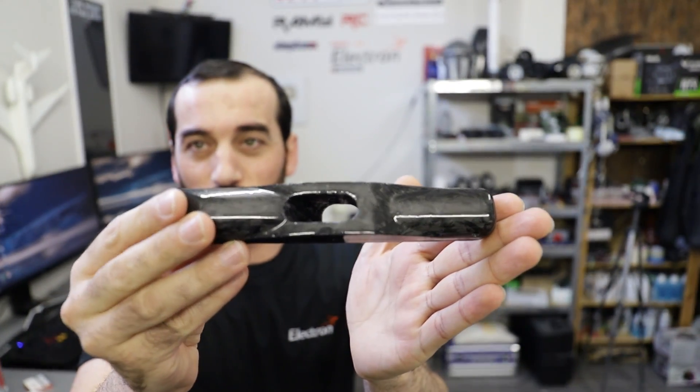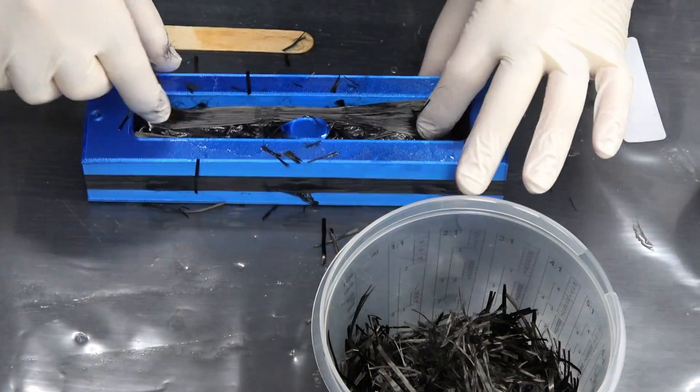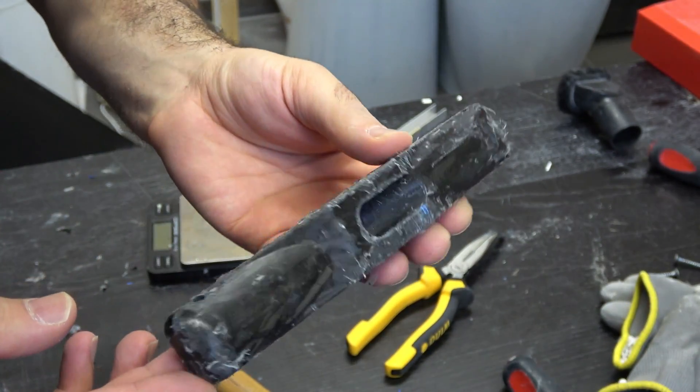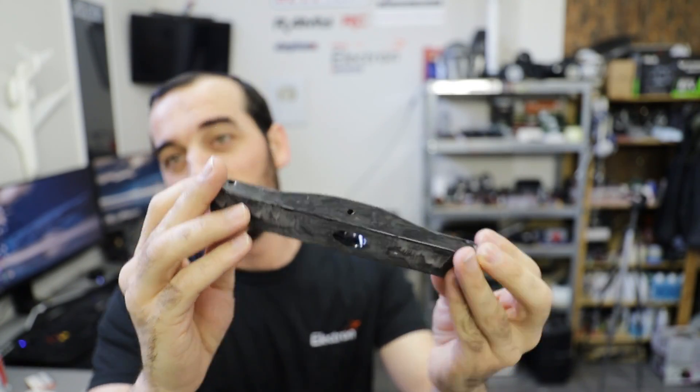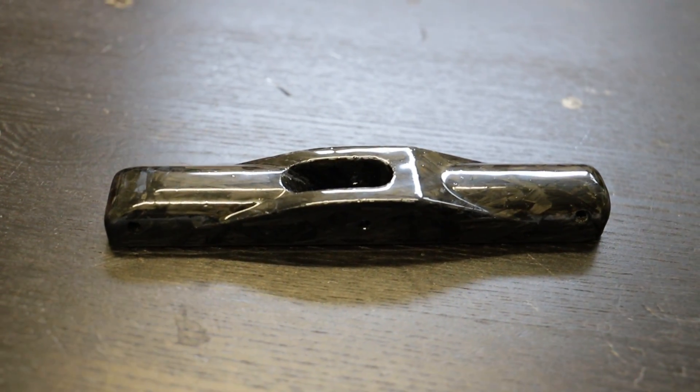And I did — let me show you. I hope the camera focuses — yes, this thing turned out so nice! I made a mold for it, pressed it, used chopped carbon fiber with epoxy, and it turned out so nice. Nothing can beat the look of carbon fiber installed on the landing gear — this will look super cool. But it's too heavy. I think it's around 120 grams because it's solid — full solid epoxy and carbon fiber. This aluminium one is just 40 grams. I thought about making a second mold that's hollowed from inside, with a wall of 3 or 4 millimeters thickness, but it would still end up around 40 or 50 grams and too much work.